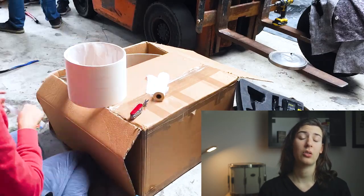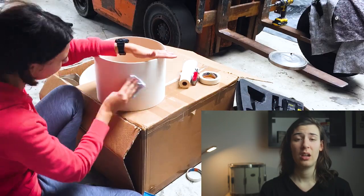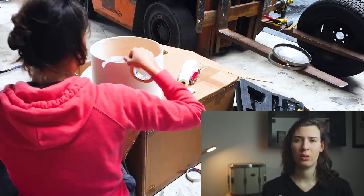It has good results — it does not damage the inside when you spray gun it or when you are staining it. You don't want to paint the inside and don't want to fill it with all kinds of ugliness. Just stay clean with it. Try to take some distance from the spray gun and don't spray too close, because then the spread is very short and way too dense — it's gonna look really horrible. Try to take at least 30 centimeters.